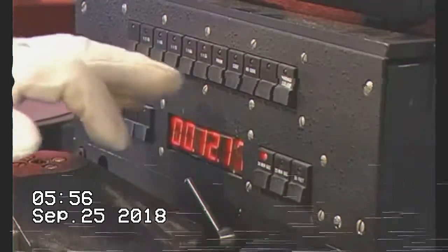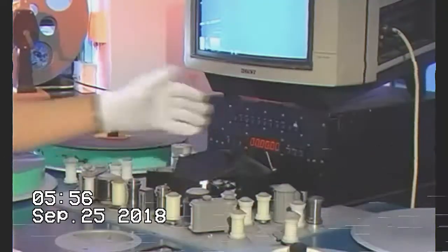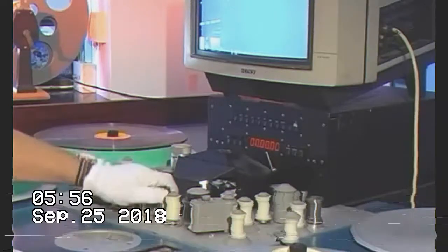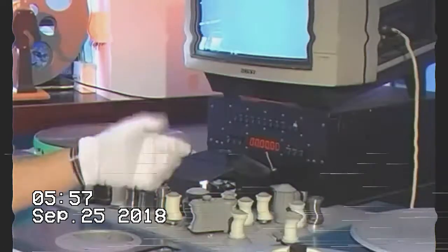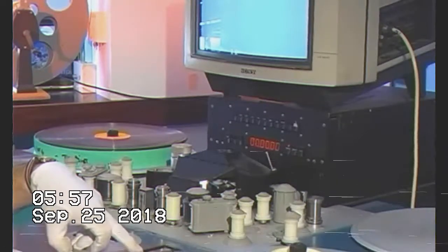If we've got widescreen films or normal ratio, we've got a timecode setting if we want to have a VHS copy made with a timecode. We can run the picture separately — this is a picture head and this is a sound head, a mag head — and we can run the mag separately, so we can run them together or individually, stop one and then run the other.